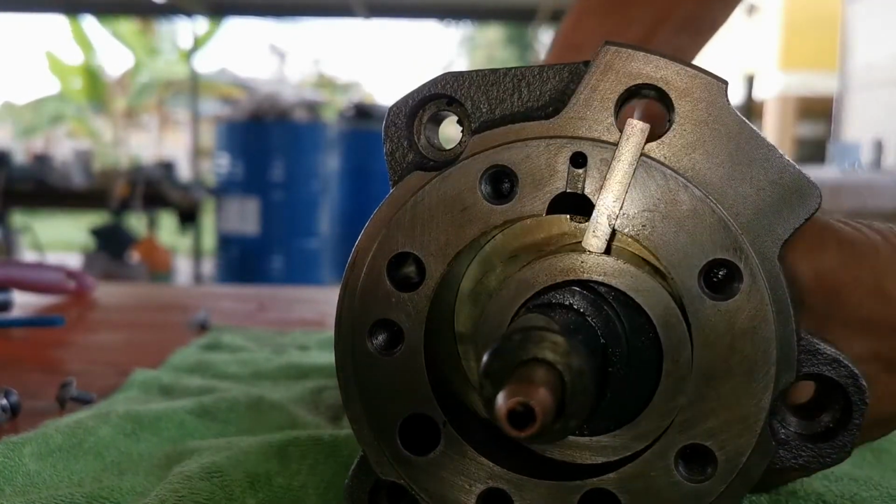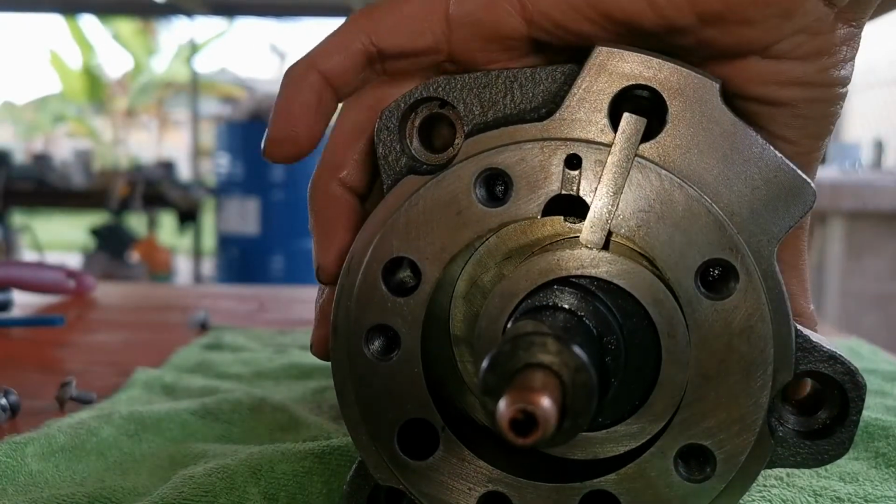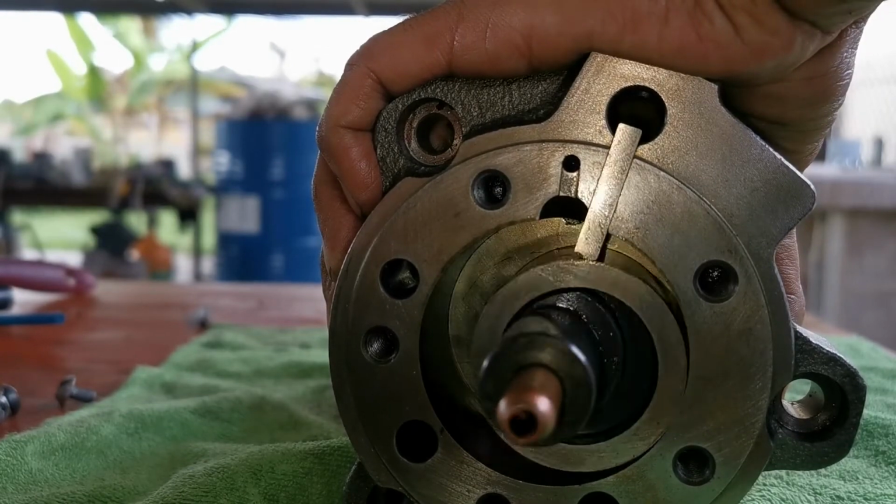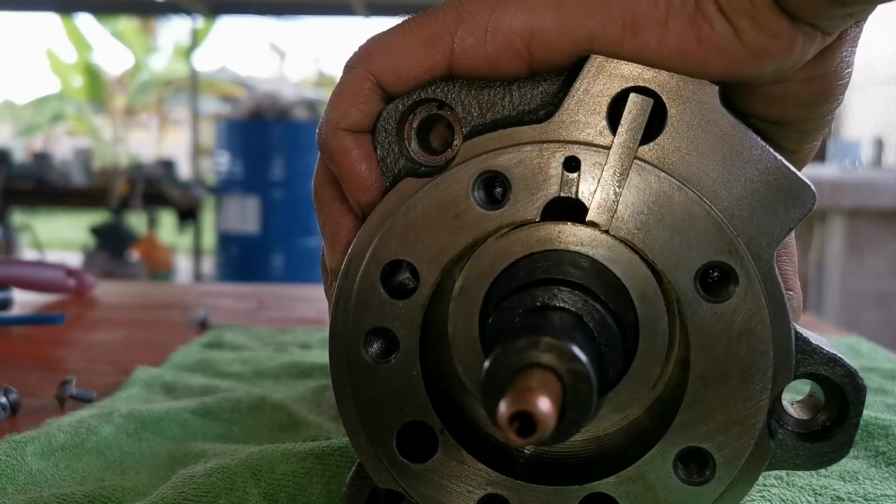Oil that flows through the refrigerant loop not only lubricates moving parts, but it also assists in forming a seal between the rotor and internal walls, as well as a seal between the vane and outer circumference of the rotor.